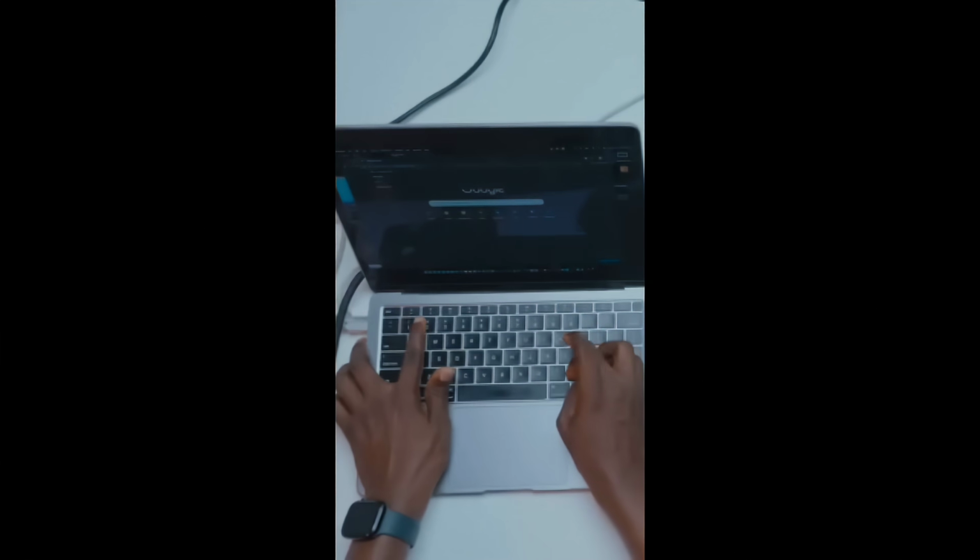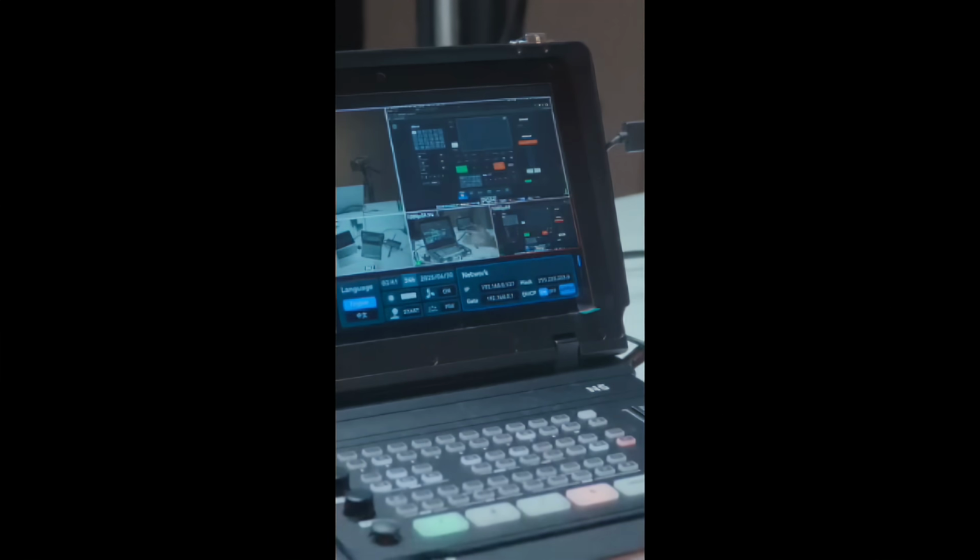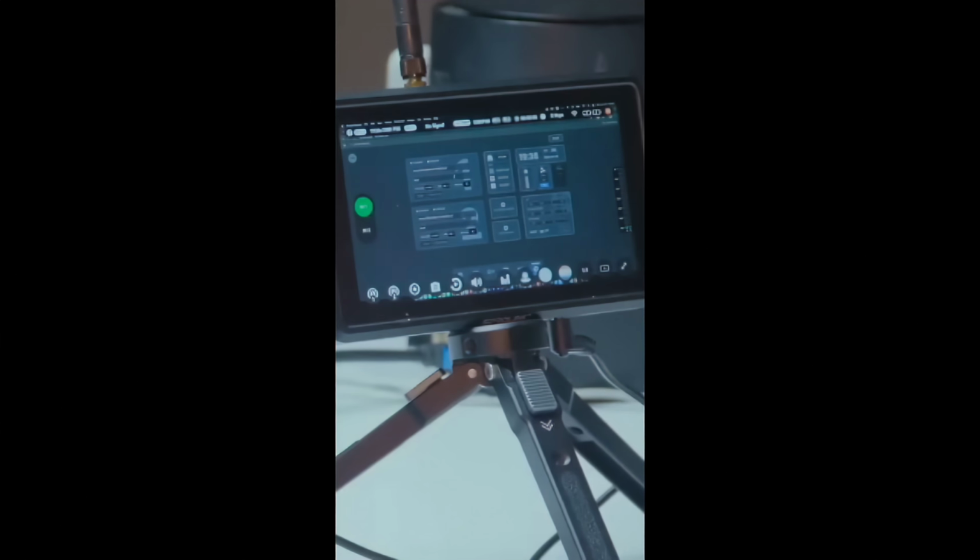Once the IP address is picked up, you can use your mobile phone to dial in the IP address that you see there, which for now we have 192.168.0.137. So if we dial that, we have this page, which is now the internet control page for our network switcher. So let me switch to that. So we have that in here. Already with this page now active, you can set up your streaming protocol, which is your RTMP and also your password. Note that you can stream to 2 destinations simultaneously. To stream, we had already set our RTMP link and all of that. All you need to do is hit the stream key right on the SPROlink N5 menu, and you should have your stream live on any of the platforms that you have set.